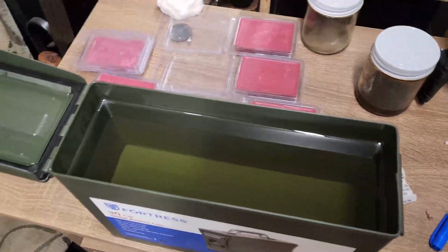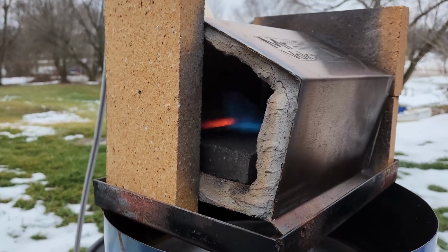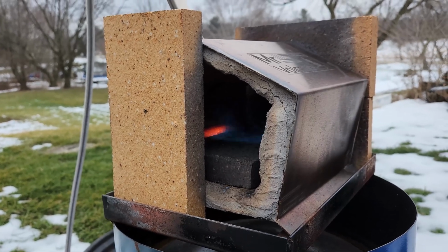The first thing we're going to do is put it through some normalizing cycles. I'm going to do minimum 3, maybe 4 normalizing cycles just to get that grain structure really nice before we put it in the oil. So we're going to start with that, grab the magnet, do some normalizing, wait for the forge to heat up because it's still working on it, and then we're going to quench this baby. Don't you love that sound? It's going to take about 10-15 minutes to heat up, so we'll be back after that.